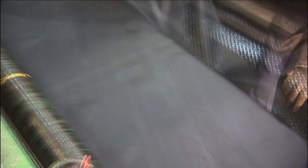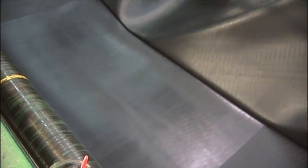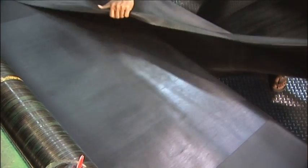At the pocket making stage, the bias cut plies are assembled at opposite bias or direction, with a thin layer of rubber compound called the squeegee in between.